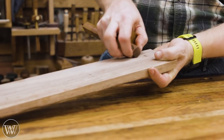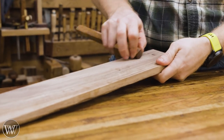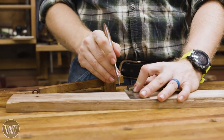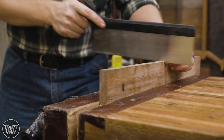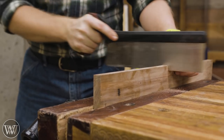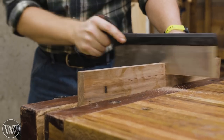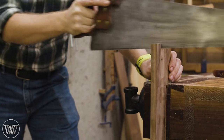For this project I'm going to choose walnut. Most of the time I like to use a softer wood — it tends to be a little lighter — but in this case walnut is a good balance of hard and durable while still being light enough to turn into a helicopter. I need a piece that is about a foot or so long, about a quarter inch thick, by about three-quarter to one inch wide. In this case I decided to make a piece one inch wide by approximately a foot long.